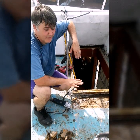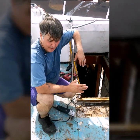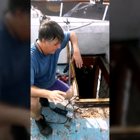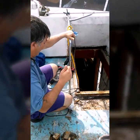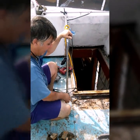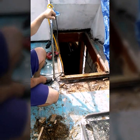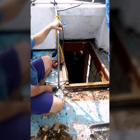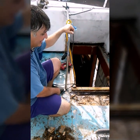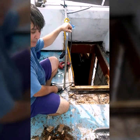I let the epoxy cure a little bit — not fully cure, just start to set off. When it goes off a little bit, I'll come back and put another epoxy layer over the top. I'll take the fiberglass panels I have cut out — cleaned, prepped, and painted with fresh epoxy on one side, rough sanded so they'll bond — and push them into the new epoxy. Then I'll put a piece of wood across the corners, pull it down, and screw that down into the deck around the sides to push that panel back and make full contact. When it cures, you unscrew the wood and it pulls right up, and the panel will be fixed firmly in place.